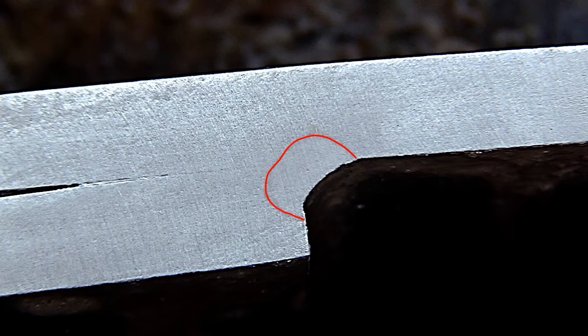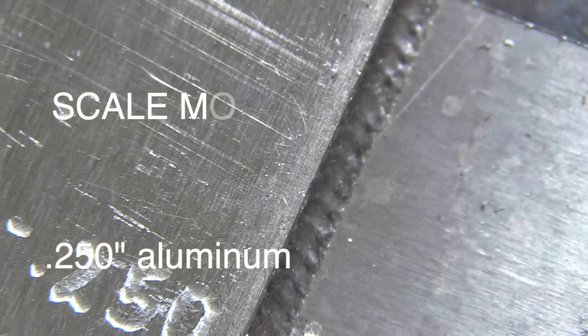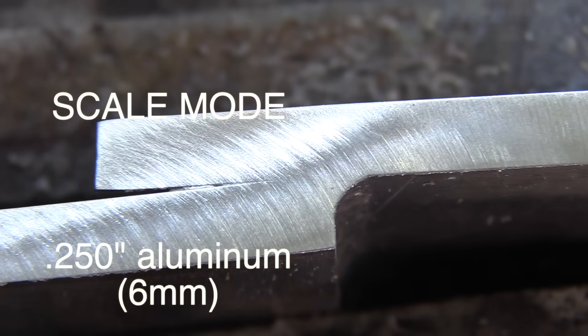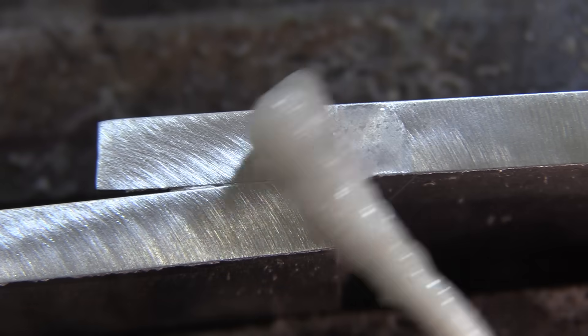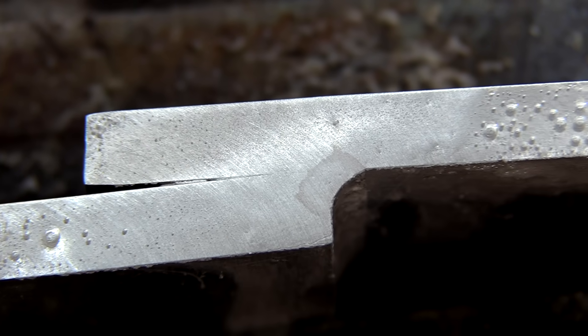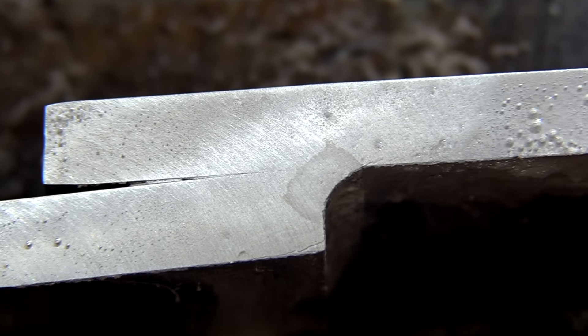That's a really small weld, but look at that penetration — that's a nice weld nugget. We'll take a look at another weld with slightly different settings using the scale mode; you'd expect less penetration since it's like pulse TIG, but it got in there as well — it almost looks just like the other one.